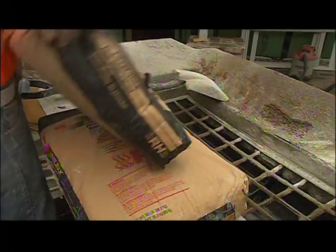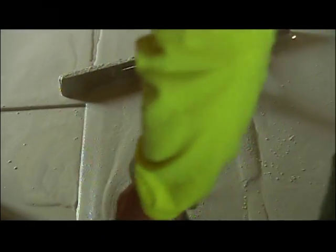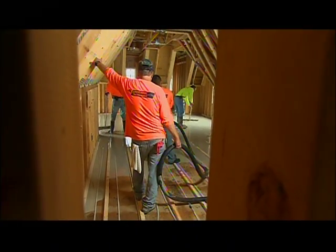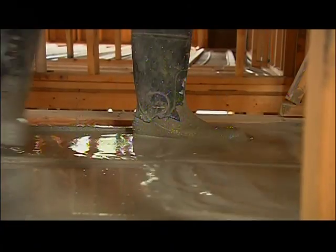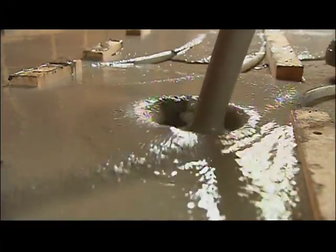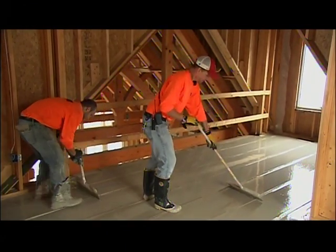For the upper floors, a different kind of underlayment is used to embed the tubes, and it's a good idea to get it down as soon as the tubes are in. It's a combination of gypsum, sand, and water, mixed in a truck and pumped through a hose to pour out on the floor in a very controlled fashion. It sets up so quickly that you can literally walk on it within a couple of hours. In addition to its thermal mass qualities, it also helps with sound control — reducing both impact sound from stepping on the floor and sound transfer between rooms. This gypsum cement bonds to the wood subfloor, creating one very strong bonded floor, typically rated at 2,500 PSI.